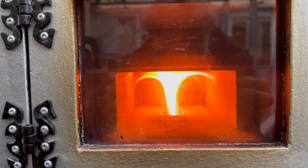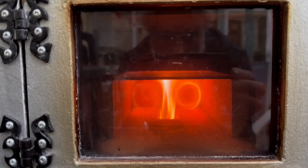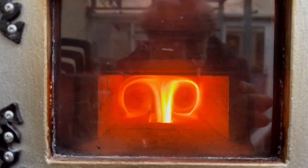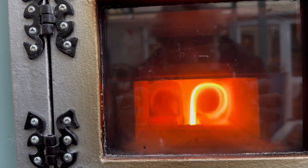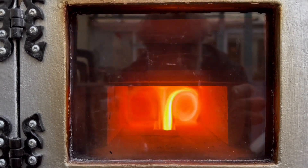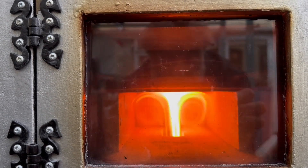The flame looks a little bit starved, but the fire is burning nicely and we've got no issues with over-fueling. The vortex is staying right near the back and the afterburner chamber is starting to glow red hot — so it is working. It doesn't seem quite as lively or as powerful as when we had the larger 60mm gap, now reduced to 45mm, and that definitely seems to be having an effect.